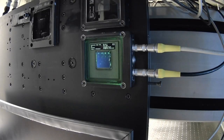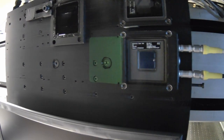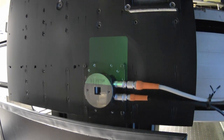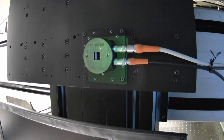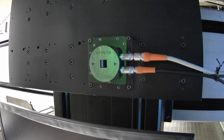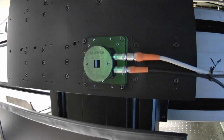Number 6: Non-uniformity and substitution principle. The non-uniformity of the monochromatic irradiance in the measurement plane should be as good as possible. The purpose of the reference device is the correct determination of the spectral irradiance which illuminates the device under test. Non-uniformity of the monochromatic irradiance generally falsifies this measurement. If the non-uniformity is reproducible, it shall be measured, leading to wavelength-dependent non-uniformity correction factors. If technically possible, it is recommended to determine the average spectral irradiance by scanning with the reference detector the entire area illuminating the device under test.